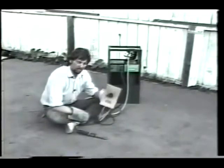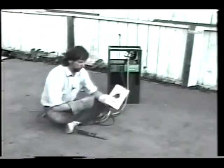You can adjust the flow of the oxygen by adjusting the pounds per square inch. You get a hotter, more direct flame for concrete, rocks, bricks, 40 to 50 pounds per square inch. For simple things like safes, hard plate, and steel, 10 to 20 pounds per square inch goes through it like a knife through butter. A couple of interesting things about this torch.